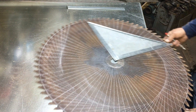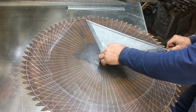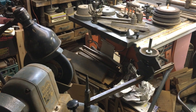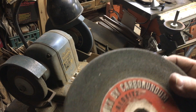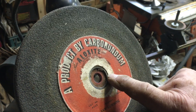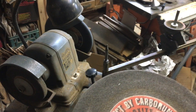Again, is this absolutely perfect? If the angles are absolutely perfect and correct, hell no they ain't. But it's a heck of a lot better than trying to freehand it with an angle grinder. I measured the existing gullet — this particular one was a three-eighths. So I had to dig through that stack of gumming wheels on the table saw until I came up with the right one. Here it is — it says right on it: saw gumming wheel, eight-inch diameter, one-inch bore, with a half-inch by one-inch bushing in it, and three-eighths in width. So this is going to cut the size gullet that we need in that blade.